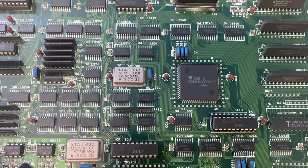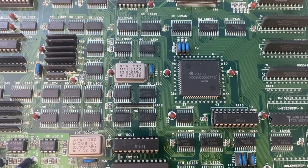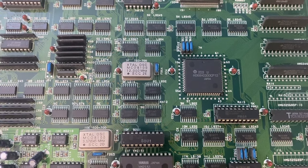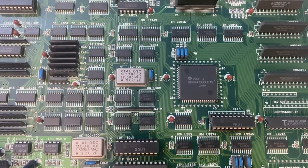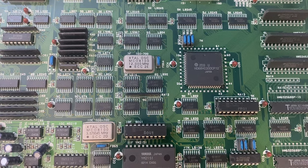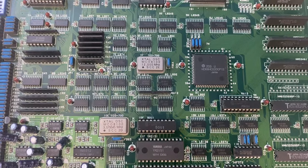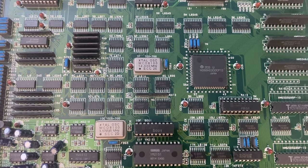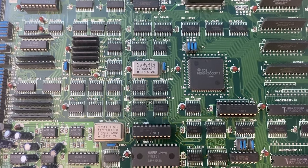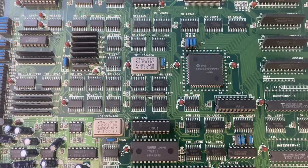The early CPS games ran at 10 MHz while the later ones ran at 12 MHz. Early games like Strider run fine on a 12 MHz board — they perform identically at both speeds under normal conditions, but when the board is loaded with lots of enemies, the 12 MHz board doesn't bog down as much. You can use the Multi on a 10 MHz board, but some games expecting 12 MHz might slow down more than expected. A clock mod is also in development to let the Multi switch clock speeds on the fly.